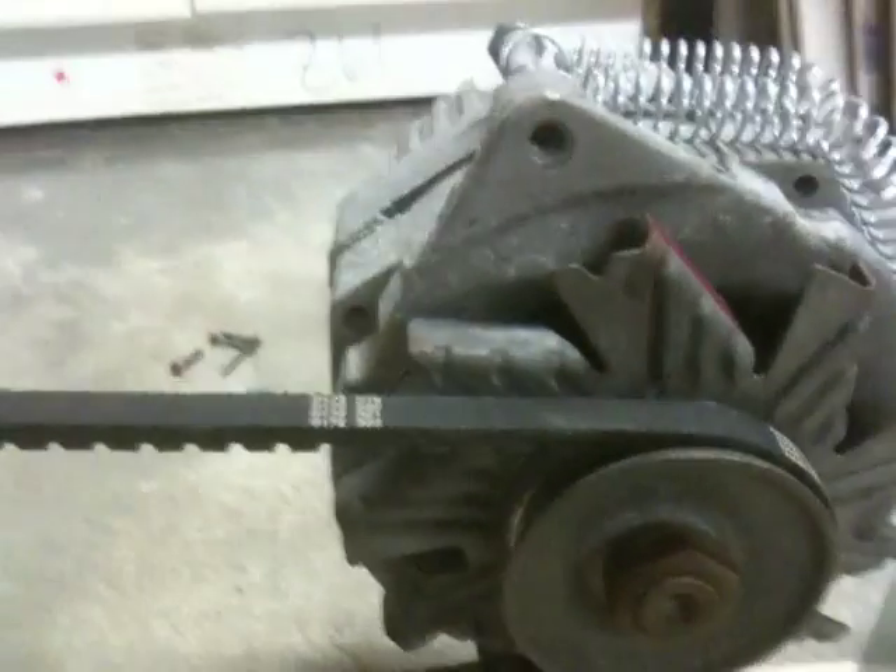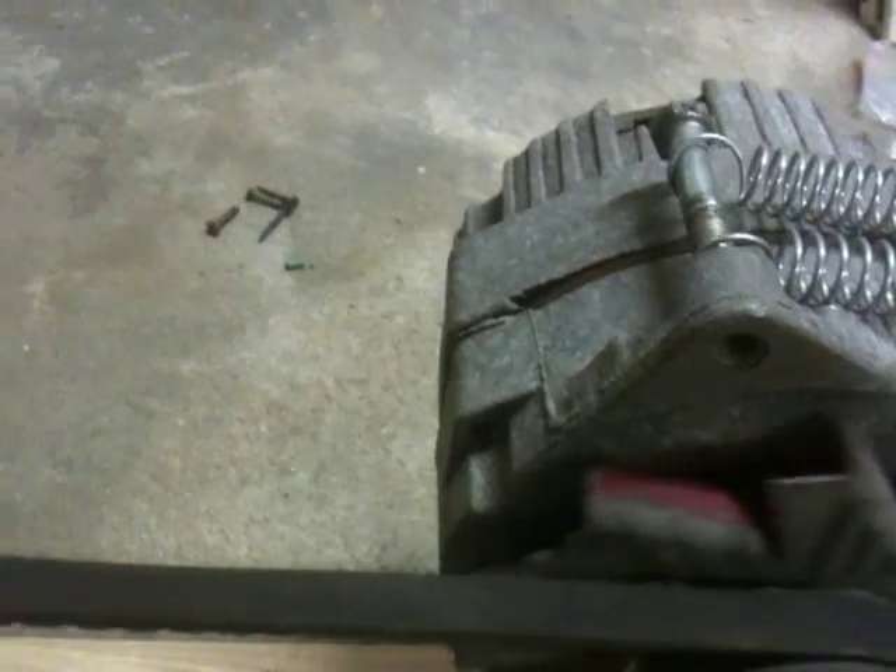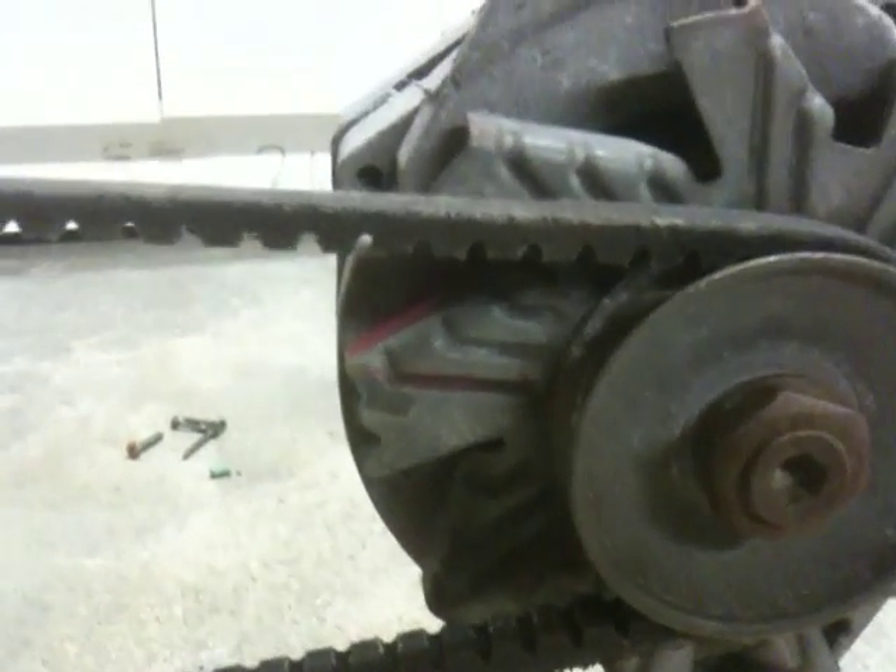I got it set up on the big pulley right here. If I crank this back, you can see that the holes line up — this hole lines up with that bolt down in there. That makes that little red line straight up and down. So if I turn this one full revolution — there's one revolution — the red line has gone past twice and ended up over there. So I'm going to call that about two and a quarter.